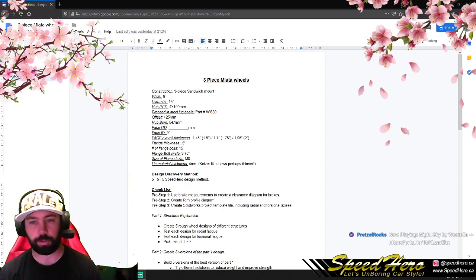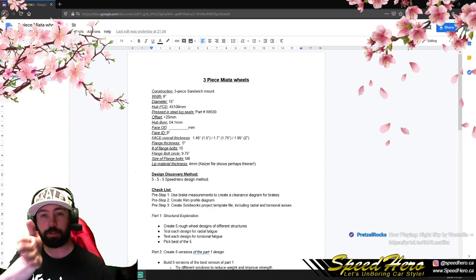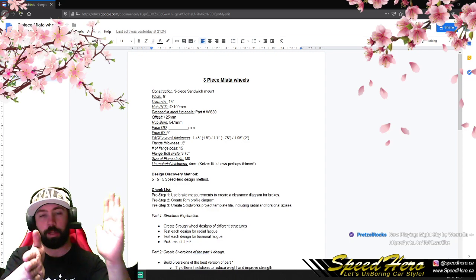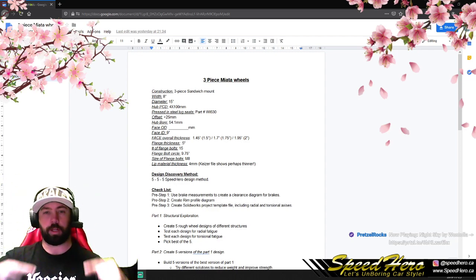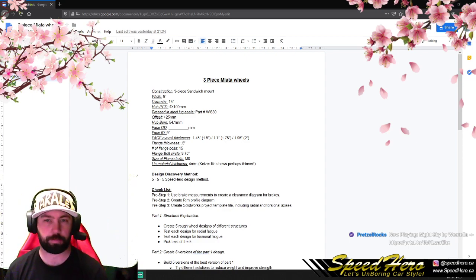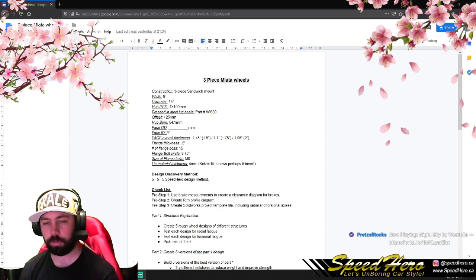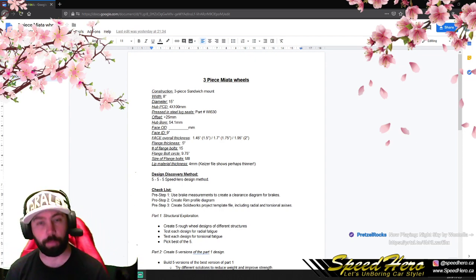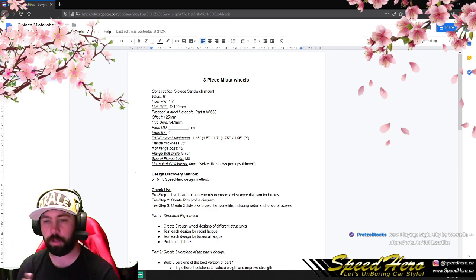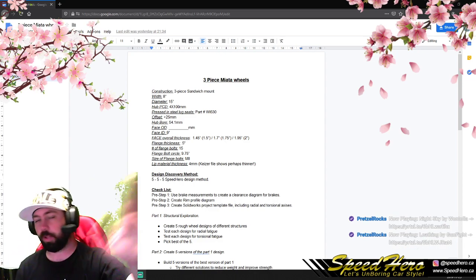Our offset of our wheels is going to be 25 mil. So if you leave the face of the wheel centered, we're going to move the hoop or the lip of the wheel back. If we have our wheel like this, we've got our center, we're moving the whole tire back 25 millimeters. The face is essentially 25 millimeters closer to the outside of the car. That's the offset. Our hub bore, how big of a hole we have to drill in the center, is going to be 54.1 millimeters. I don't know our overall face diameter, but that's totally variable, that's okay.